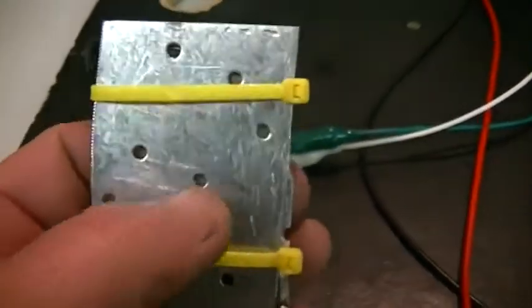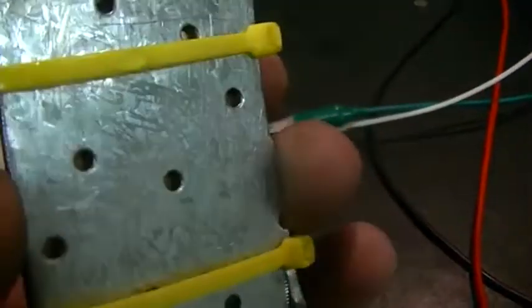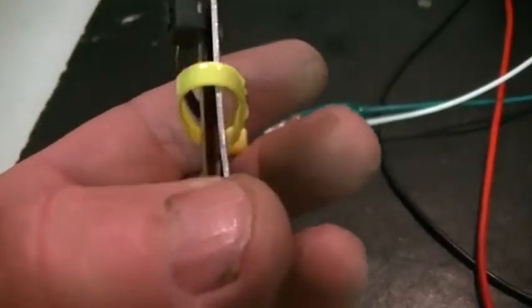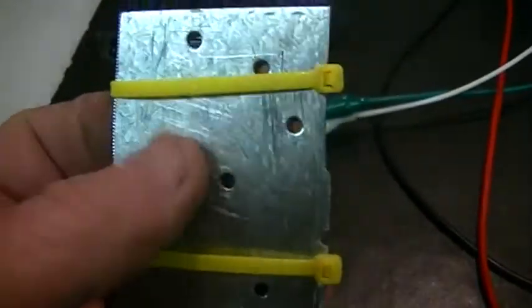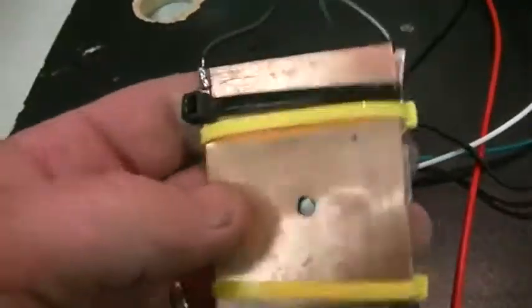It's got our zinc plate — that's a bit of wall plate, it's full of holes; it'd be better if it didn't have holes. Just a zinc plate. A bit of copper plate, that's probably about 0.8 mil thick, something like that, 0.7. So not very thick; the zinc's 1 mil. Thinner will be alright because we're not actually going to be peeling the zinc off. We're basically going to be making a super capacitor that loves being post-charged and recovers quite well.